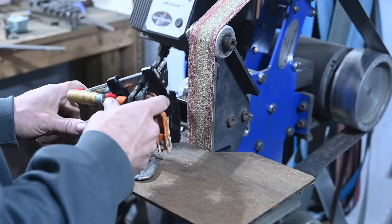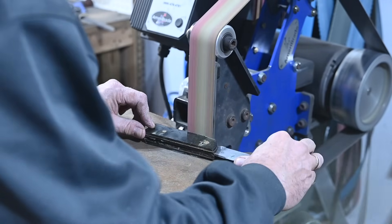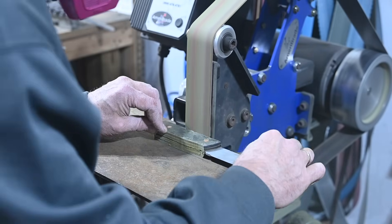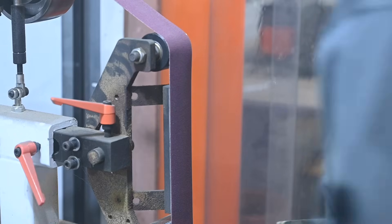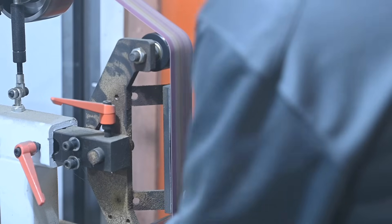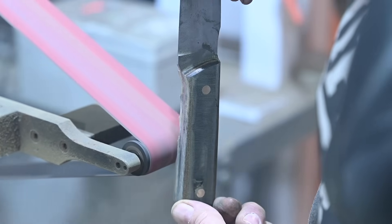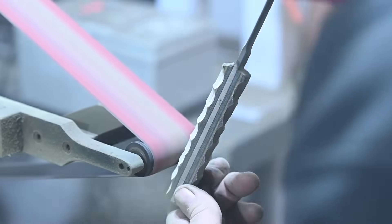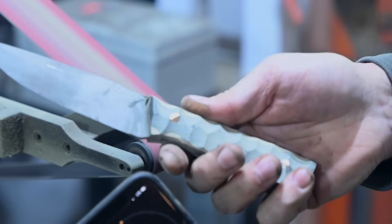Now, time to blast away on the handle. By the time I'm done, the epoxy should be at least workable. In a perfect world you go 24 hours of full cure before you grind it, but that ain't happening. If you're looking to make the best knife possible, you obviously wouldn't do it this way. But making a $10,000 work of art is not the goal — we're all about fast today. First the pins and then the outline. Then we'll grind an ergonomic profile. And here's our time running out — three, two, one, zero.